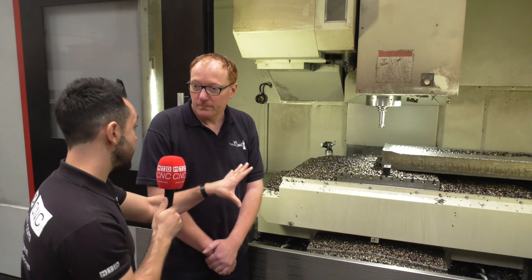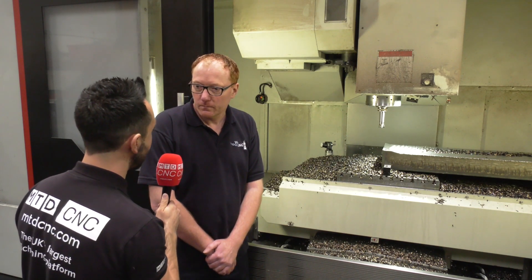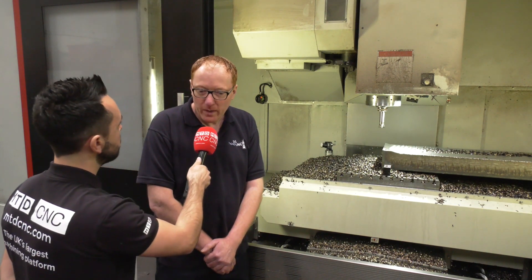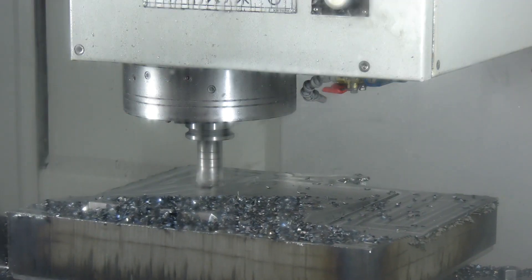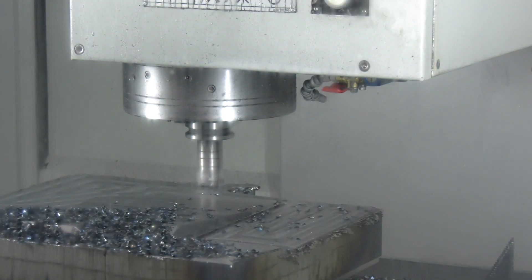Now this is op one, so repeatability is not really an issue there, but what about second op work — what's it like for that? Repeatability is brilliant. You put the little end stops in, set them up, and it's almost like jigging — put them in, push them up, and away they go.